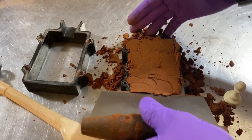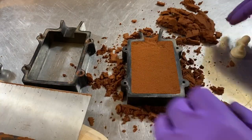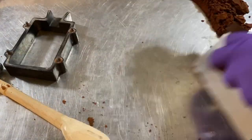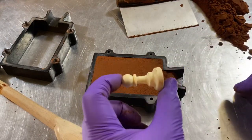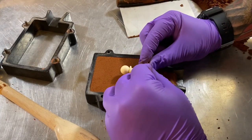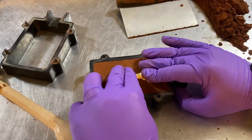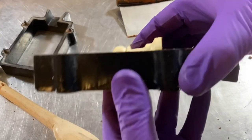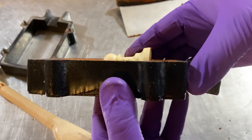Now that we have the clay packed into the bottom, we'll go ahead and scrape it off so it's nice and flat. I like to flip it over and scrape the backside as well, just so we have an even working piece. The next step is to press the piece into the clay — you want to make sure you press it only about halfway. It's very important that you don't go over or under halfway, because you want the other half of the mold to have basically the mirror image. If your 3D piece has two different sides, just try and find the middle. The clay should be very flat.